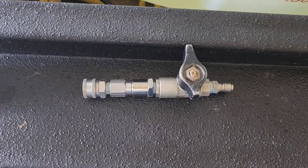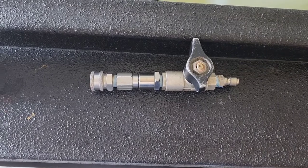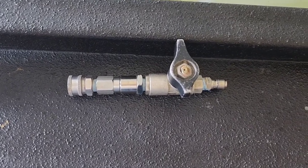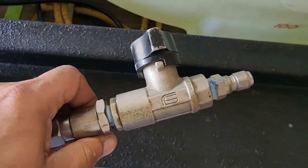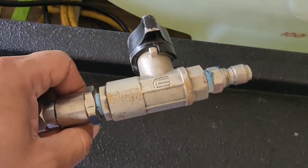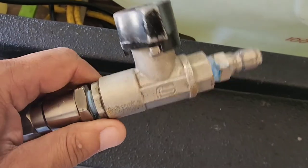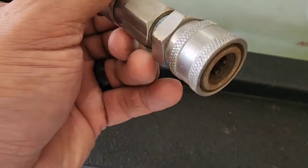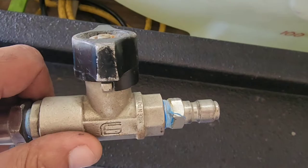I'm going to share something for guys that like to use their ball valve when rinsing or even applying a chemical. So I have my standard ball valve right here. I like to use the male-in/out because when working with hot water or just in general when you're rinsing, if you have your female side with the quick connect you risk blowing out an o-ring — so that's why it's better to use male-in/out.